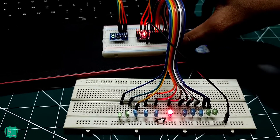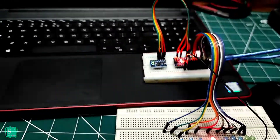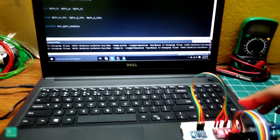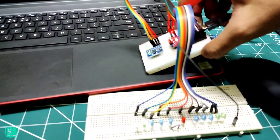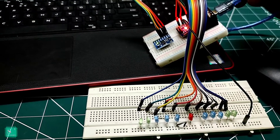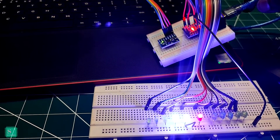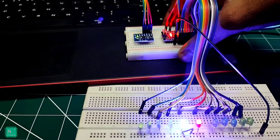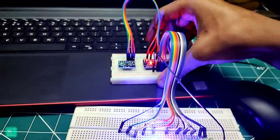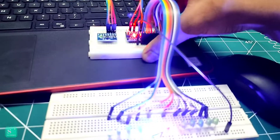You can see the red LED glowing — that means it is perfect and it will now glow correctly. But if you are not holding it flat, you can see I am now demonstrating the fault. The code has already uploaded, but I am holding it incorrectly. Now let's see what happens — the gyro is calibrating. After the gyro has been calibrated, the LEDs will glow. As I keep it flat, the blue LEDs are also glowing, which is not desirable. So you must hold the gyro sensor on the breadboard flat while it is calibrating after uploading the sketch.